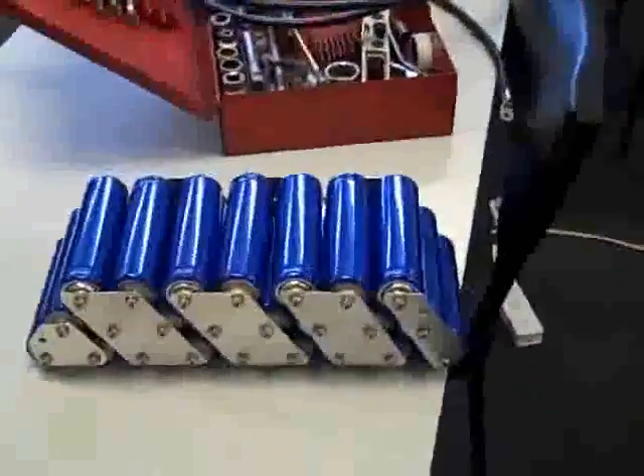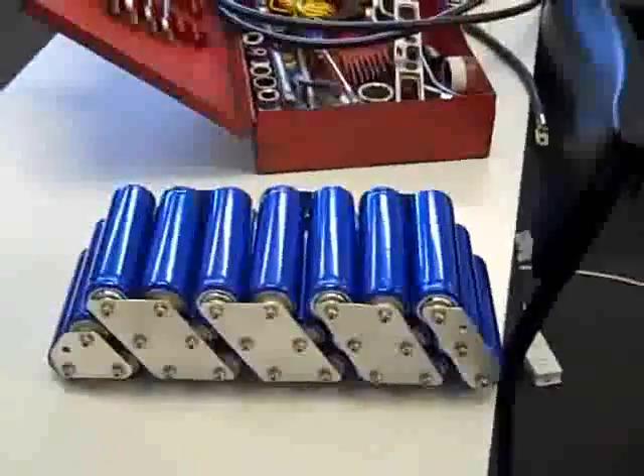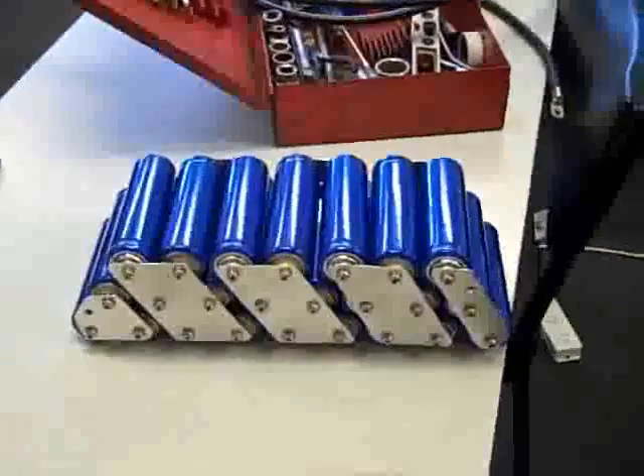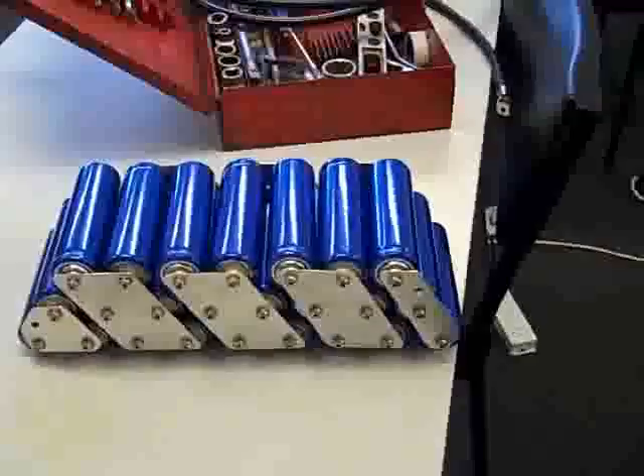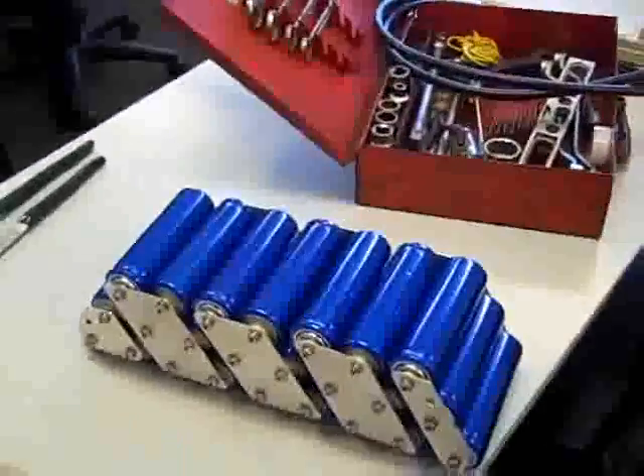What we have here is the battery pack. We've designed it so that when the cells expand, they can move — they've got a bit of a concertina effect. They'll be sitting with some rubber stays inside their enclosure so that the rubber can expand and allow movement, but they won't go bashing around as we go through corners.